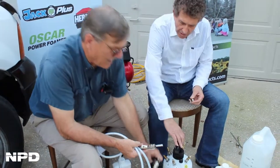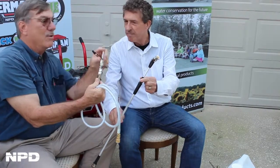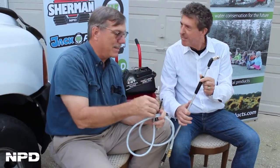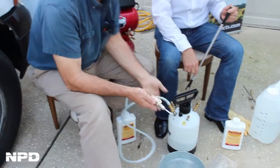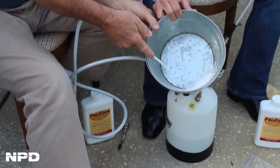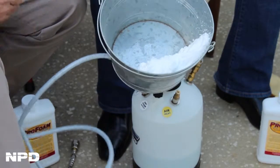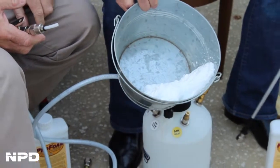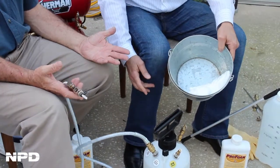We've got a variety of tips and can show how easily they clip into this unit. This seems like a great treatment tip for termite control below slab — you don't have to go very deep because foam goes wherever air exists, filling that void underneath the slab very quickly. It's great for drains too. For a drain, let's choose a dry foam for demonstration. I'll hold the bucket. There may be some water at first since it's been sitting, but it will quickly transition to a very dry foam. I'd guess this is probably about 20 to 1 — so for every ounce of water, you're making 20 ounces of foam, delivering it over a great distance very quickly. I could fill up a gallon of foam here in just about 15 to 20 seconds.